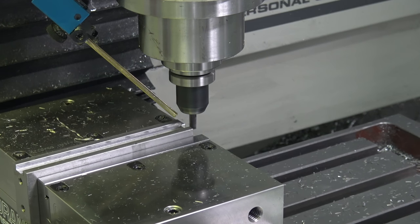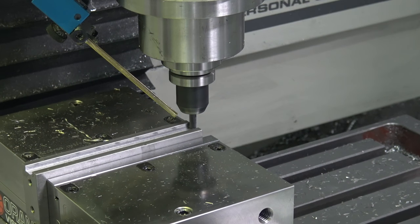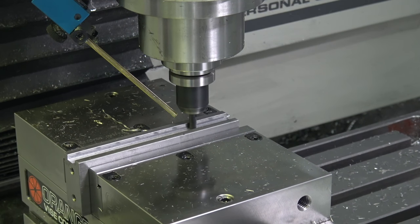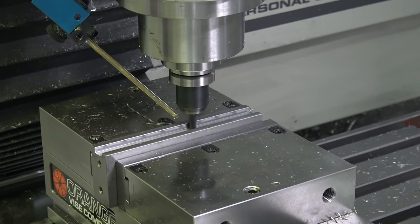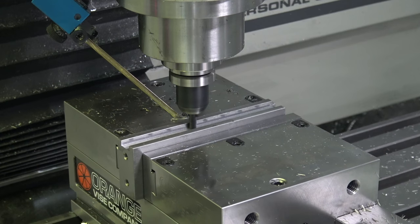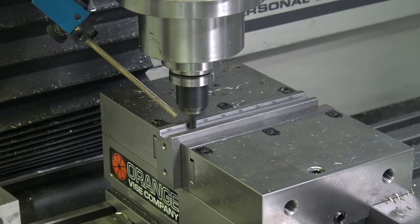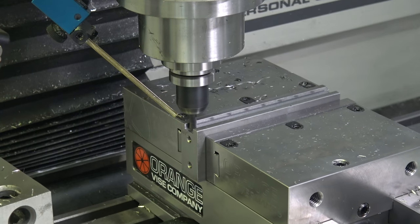Most likely, well, I want to blame the end mill. Could be a combination of end mill diameter, could be run out, although run out would make it cut bigger rather than smaller. But we'll see. I only took 2 thou additional, so in theory this should be a total of 0.5 thou off. Or if the stars align, this would fit a 499, but not a 1/2 inch gauge block. I could be wrong. Could eat my words here. We'll give it a try though.